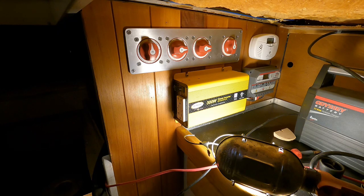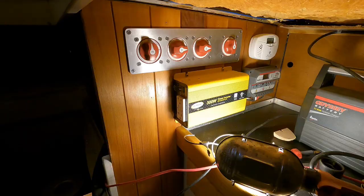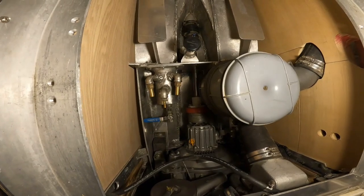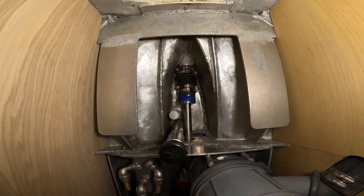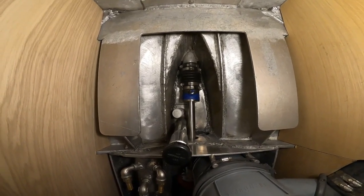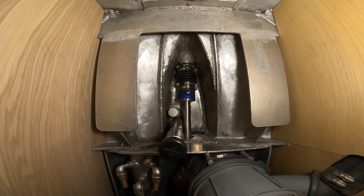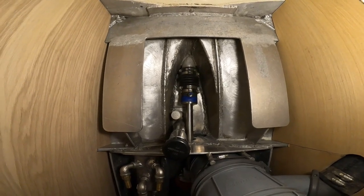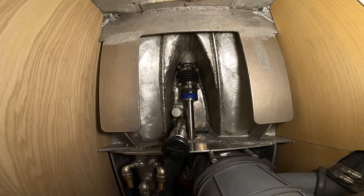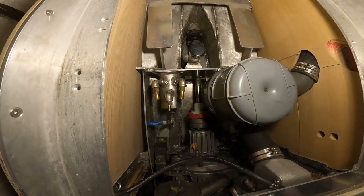It's very difficult to achieve 100% isolation of a typical marine diesel engine — the raw water cooling circuit provides a path between the engine block and the saltwater. So the poor man's way to isolate this is whenever the engine is not running, just disconnect the block entirely from the DC system. Looking straight down into the aft part of the engine space, we see the top plates of the keel tank and the new drive shaft. I've also switched over to a dripless shaft seal — this boat always had a good old-fashioned bronze stuffing box, but the bronze was likely reacting with the inside of the stern tube causing some very shallow pitting. So I went with a PSS dripless unit, and for once I'll potentially have a completely bone dry bilge.